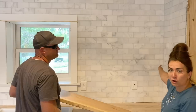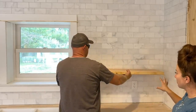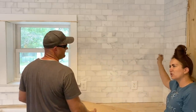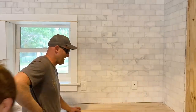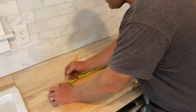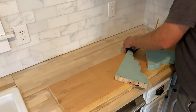We went with about 48 inches across all total, so we've gone with a 40-inch shelf. That gives us a good amount of space and we'll put the corbels about an inch and a half on the edge. I might need to find a stud for those. I do have anchors to put in there — depends on how heavy you want to weigh these down. Still need to do a few things like trim work and caulk around this kitchen and counter, but it's starting to come together.